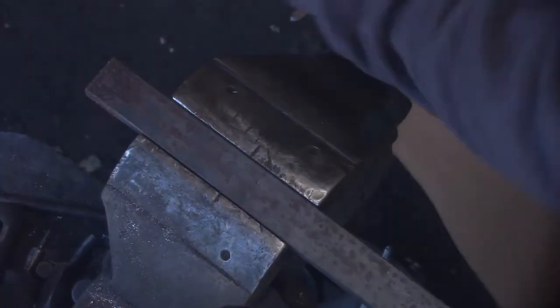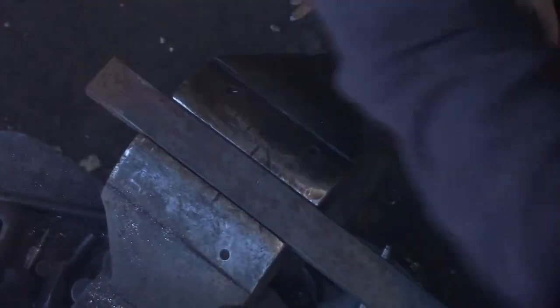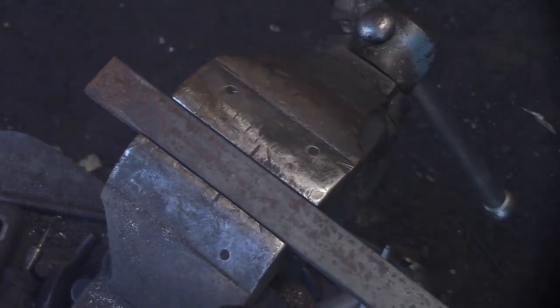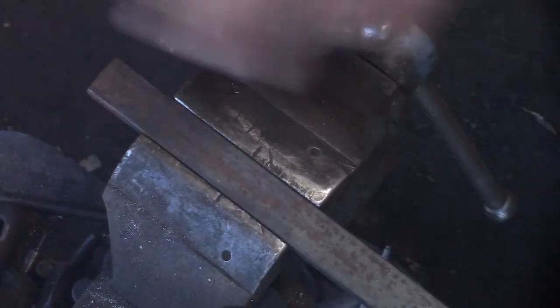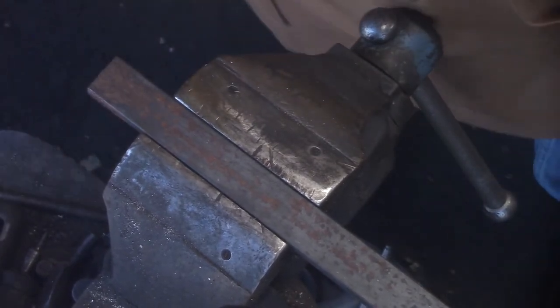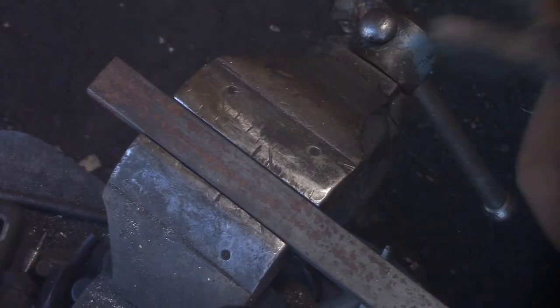I am making another pair of those tongs that have an extended boss so that I can adjust the size of the opening. I originally had hoped that I could go from a half inch to an inch, or five eighths to an inch, but as it works out, it's more like three quarters to an inch of safe positive grip, which is fine because most of the tongs I have fall in between both of those tongs' ranges.